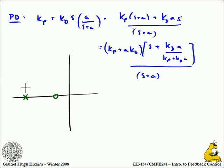Because if I have to start building this out of op amps, okay, a first order compensator I can do. But when I wind up with something like a sixth order Butterworth filter, I get very unhappy trying to build this with an op amp, because it won't work.